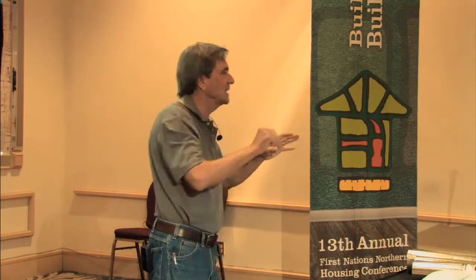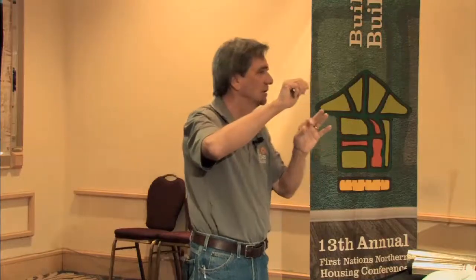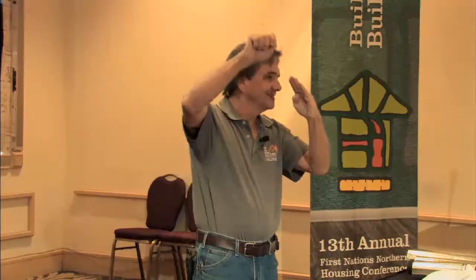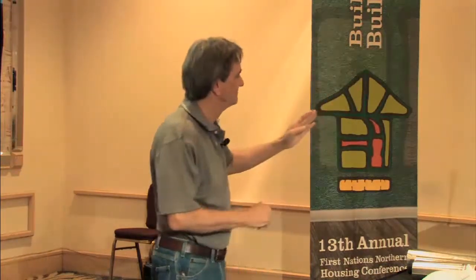When they find that, okay, that's working better, but it's kind of cold here and kind of warm there, they can open up that one a little bit. But just turn it a little bit and wait a week. Every time you make a little change, wait a week, and give it time to settle in. Then you'll start to find, of all those dampers, a little more heat back there, a little less heat here, and you finally get it distributed right.